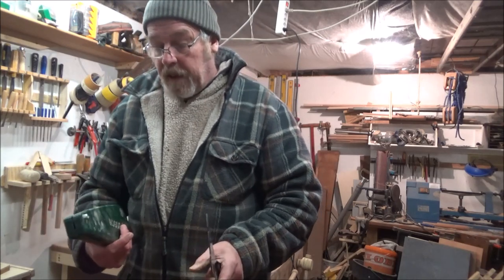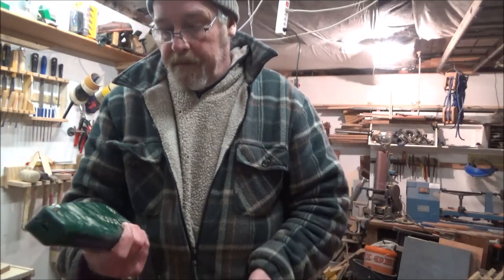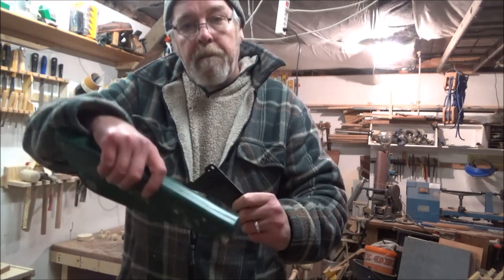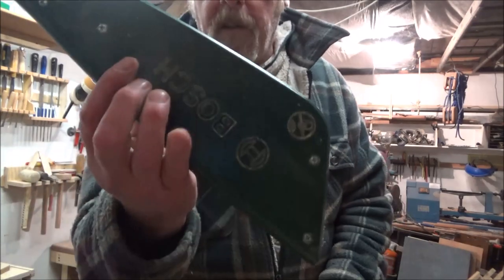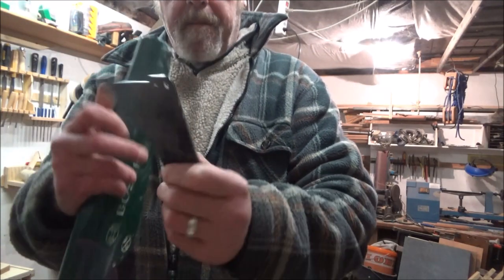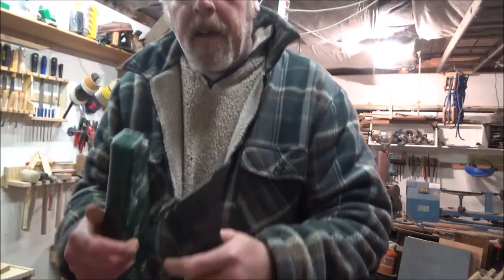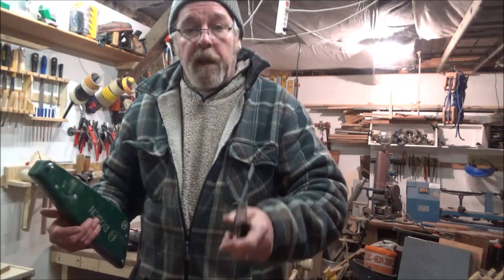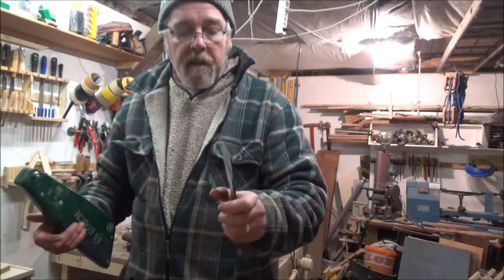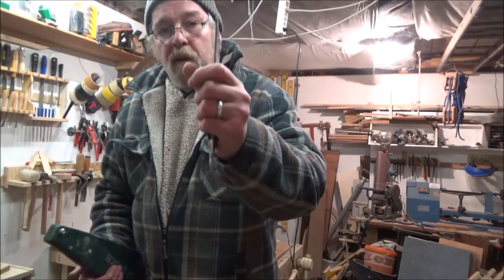The other problem with this saw is the blade guard. It's not an easy takeoff. If it were an easy one that you could just clip on, like a lot of them, then it wouldn't be a problem. You actually have to completely dismantle it. And before, there was a T-section through that. I'm still thinking about cutting that off, or I might actually make a new base plate, a zero clearance base plate that's got a riving knife integrated into it, just as a splitter. But you have to take that completely apart to get that off, even if I did use it with the sledge.